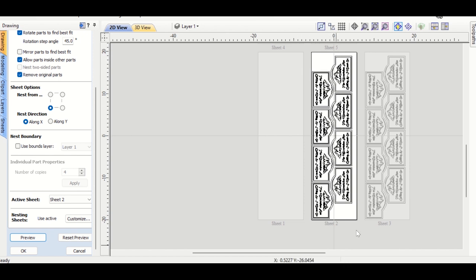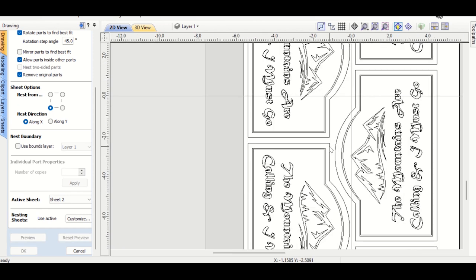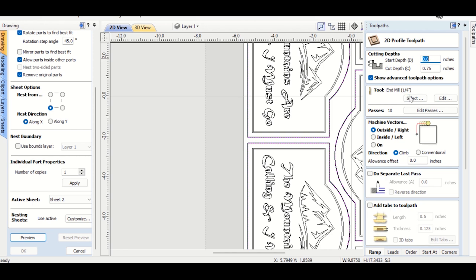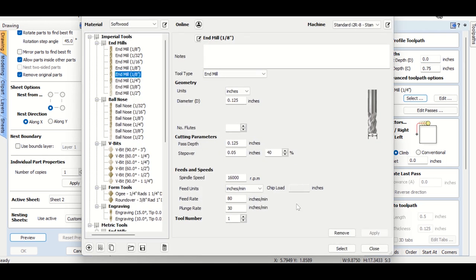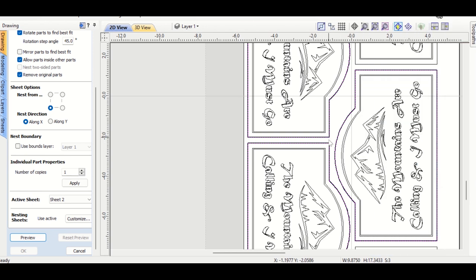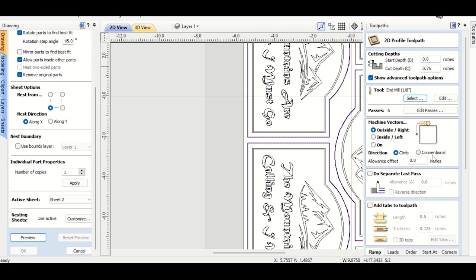I'll have plenty of room for clamps, I'll just have to move a clamp around. If you have a vacuum table or a double-stick tape method, that works as well. One thing I do recommend before doing this is to test it out first — it is pretty tight. As I add my toolpaths, I hold the shift key and click on all of them. Then for the profile toolpath I make sure I have a 1/8" end mill selected, with passes set based on your machine. Be mindful of whether you're cutting on the line or outside the line — I'm going to cut outside the line, so the toolpath comes right along the outside and will likely overlap adjacent pieces.